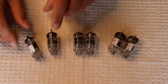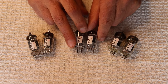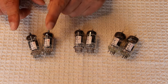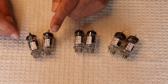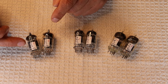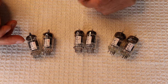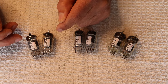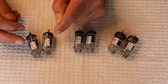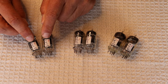Some things to really watch out for: in most cases, if you have a stereo phono preamp, you're going to have a left and a right gain channel, and probably two stages in each channel. Remember, these are two tubes in one bottle — two electric circuits, two gain stages inside a single envelope. All testers are organized section one, section two, and section three if applicable. So we test section one to section one, section two to section two. You can see that section ones are an exact match here — that is very, very unusual.